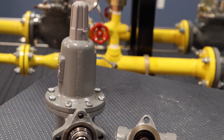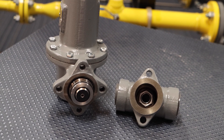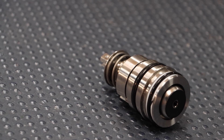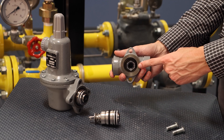The B stands for balance trim, which allows the inlet pressure to balance on both sides of the disc, unlike a traditional flow-to-open regulator. This design mitigates issues of inlet sensitivity and set-point drift to allow this regulator to achieve a 1500 PSIG inlet pressure rating using one 9/16-inch orifice for all applications.